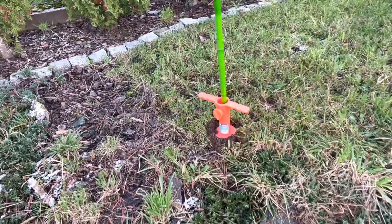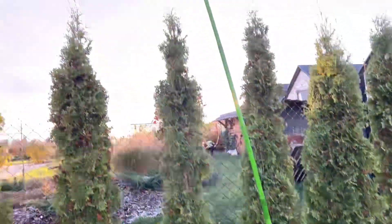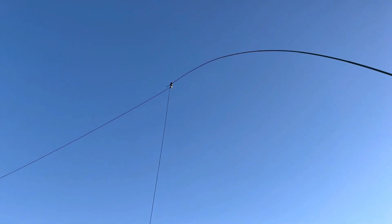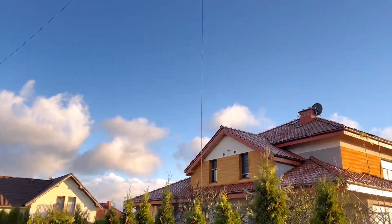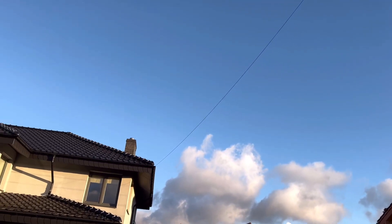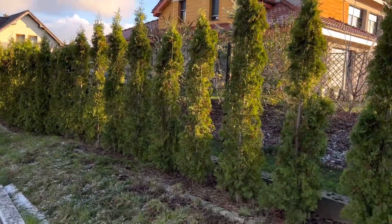Okay here's the installation. I've got a beach umbrella stake driven in the ground, a seven meter pole up to an insulator. I have wire taped to the top of the pole with the vertical wire straight down. It's about five meters long and the other wire is straight over the top of the second floor window. There's my inverted L EFHW half wave.